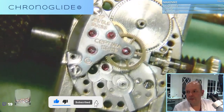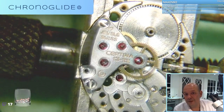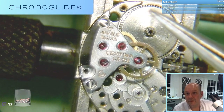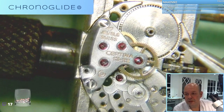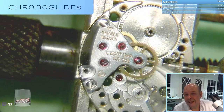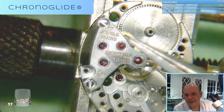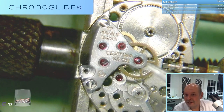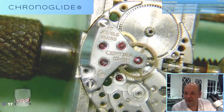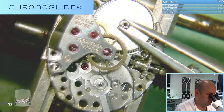There's the main barrel. In a minute we can probably see what is going on in the gear train. This is the main barrel with the mainspring. First I want to remove the barrel and then blow some air against the center wheel as a test for the complete gear train, because nothing would block it then.